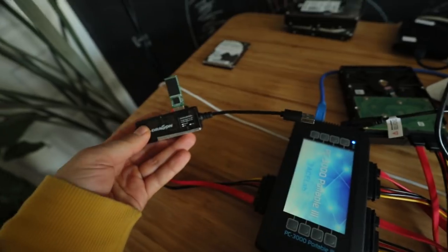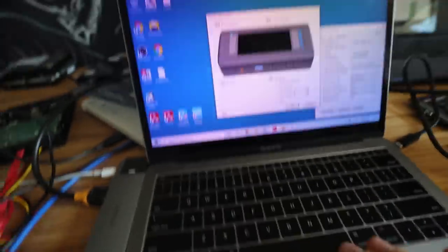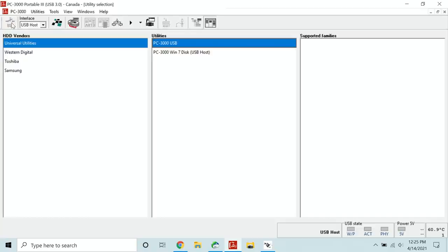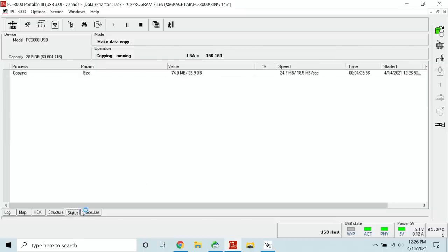I have this target drive that I'm going to plug into the USB port on Portable 3 — there we go, that's plugged in. In the utility I've selected to image the device onto port 1 hard drive. When the utility is loaded up, we power on the USB device, it is connected, and now we can start our task and fire up the transfer process. Let's have a look at the speed — it's running at 25 megabytes per second, which is pretty good.